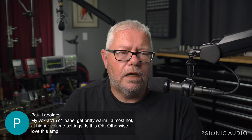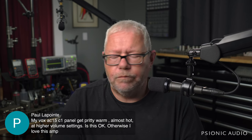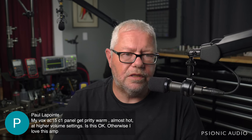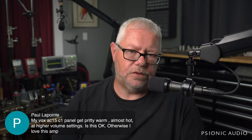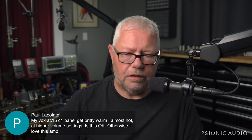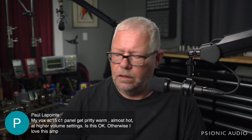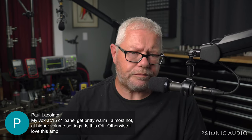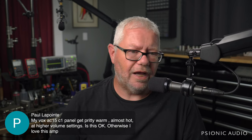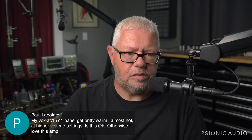Hey, Paul. Yeah, AC15 C1s get hot. Most amps get hot. Won't hurt a thing. They're designed to do that. Tubes are quite happy at temperatures that will quite literally burn the hell out of you. And the metal does not get fatigued from that, and the metal panel will not get distressed from that. And the wood handles it just fine. You're not going to have any issues running that thing hot. Unless you smell or see smoke, you're fine.